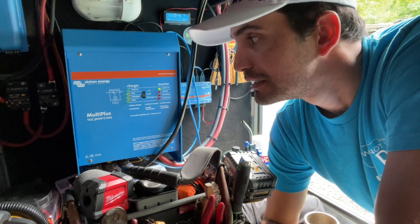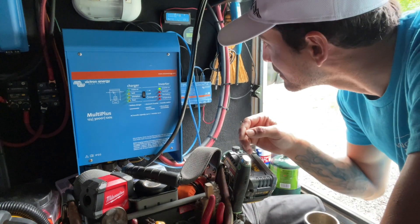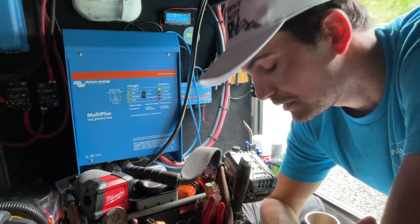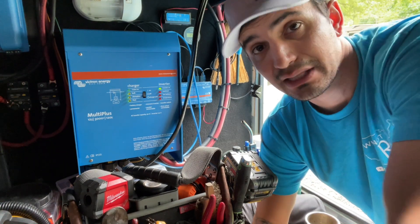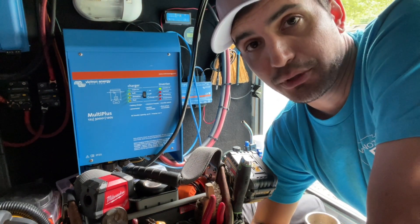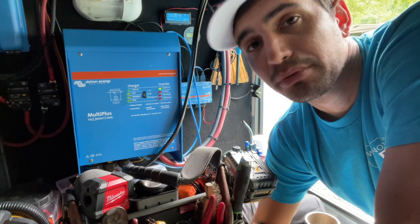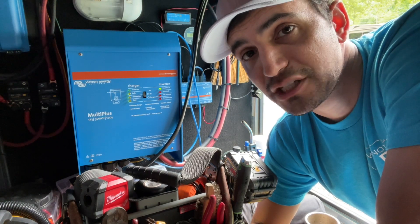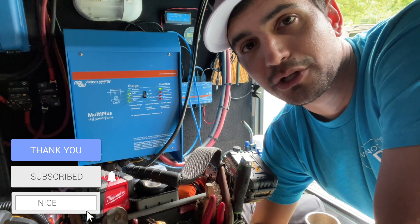Now there's a lot of extra stuff with the MultiPlus that you can get but don't need, such as the Cerbo GX so that it's all online, a battery monitor, the USB dongle, and there's a Bluetooth dongle. But you don't technically need any of that stuff. All you really need is the MultiPlus. The Bluetooth dongle is really helpful just because right there on your phone you can pull up the MultiPlus, program certain things, turn it on or off, tell it what amperage you want to pull. So that's pretty much it on the Victron MultiPlus. Please drop a comment below, shoot me a direct email, come join us online at our Facebook group — Why Not RV under Facebook groups. Please hit that subscribe button, drop a like. We'll see you next time. Thanks for watching Why Not RV.